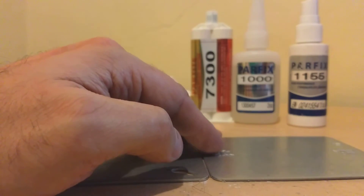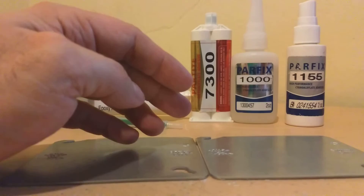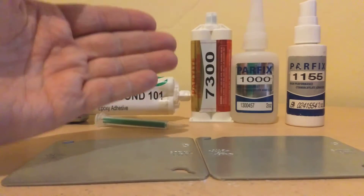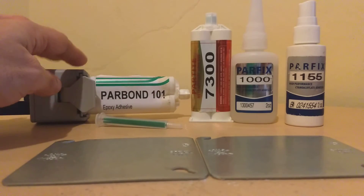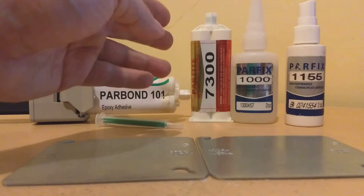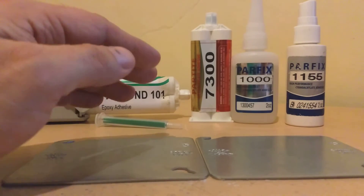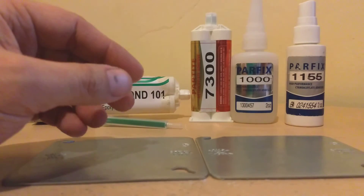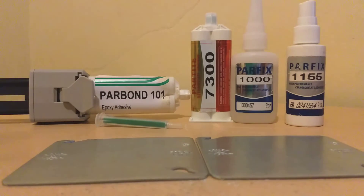Those are the options, and it's something you have to take into consideration. If your customer wants speed, you're going to have to go with the CAs or instant adhesives. Although we can get pretty quick with the epoxy and methacrylates — down to a couple of minutes — you still have to dispense the equipment. A lot of workers sometimes can't use those dispensers when they're on the line, because they don't have time or they have other things to manage. So you've got to look at the whole situation to determine what is the best, and that's what I do.